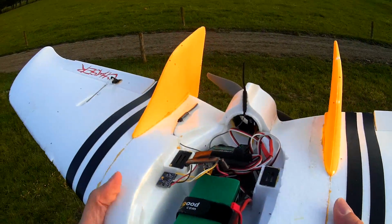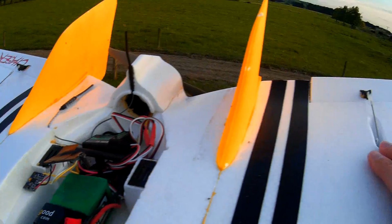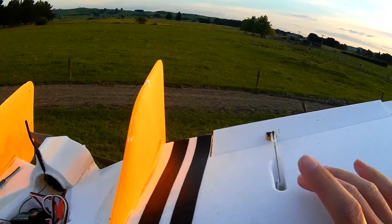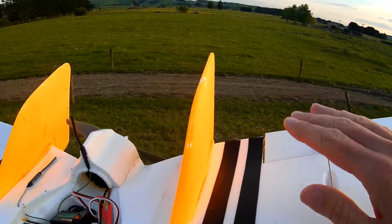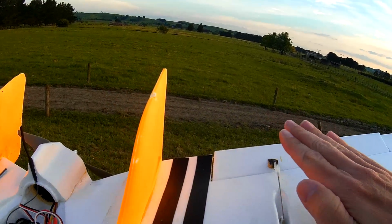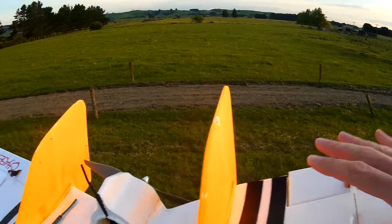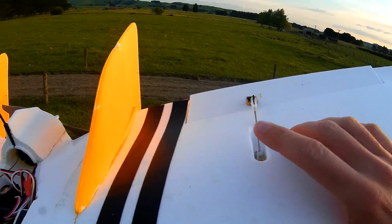A couple of other things I had to change while I was twiddling around today was that the servos I'm having here are a little bit different to the ones I was using while I was testing at the desk. Seems like different servos like to have a different frequency of pulses. Usually you can manage with 50 Hertz, but I found that 50 Hertz made these move a little erratically. They moved, but they weren't very smooth at all. And 250 Hertz, which is what I was using with the ones that I showed you at the desk before, they moved quite smoothly, but occasionally they get a bzzz noise like that, and they wouldn't move at all, just for 2 or 3 seconds, and then they'd come right. I didn't like that, but I found that at 100 Hertz, they seem to be okay. So they are those servos, just in case it makes any difference.